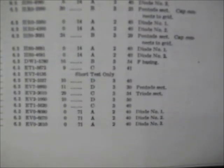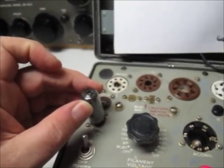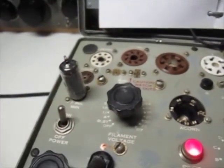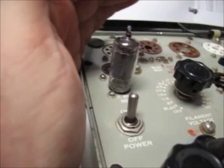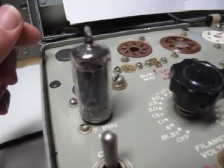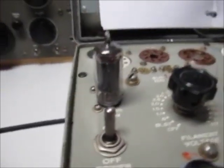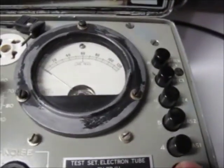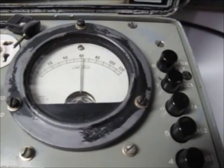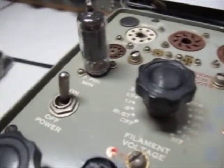We'll take our trusty bag of valves and pull one out. This is a B7 valve base — pins are reasonably straight. Bear in mind these tube bases are quite old. I'll try to put it in and look for a little bit of heating coming up. As you can see on the side of the tube, there's a 6BA6, and it looks like it may be warming up. We'll go to the GM conduction test. This particular tube is coming up — it's looking at around about 70, going towards 80. It just took a bit of time to warm up — you can see the actual heaters down in there.